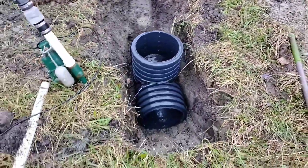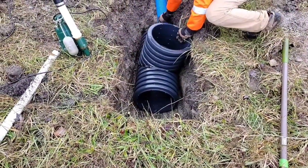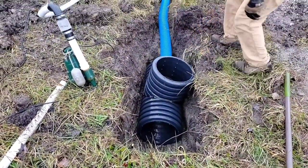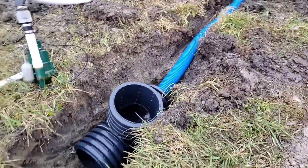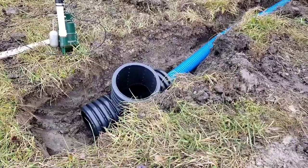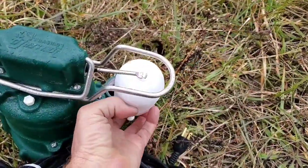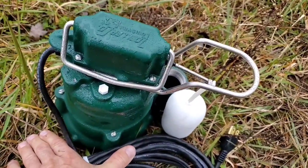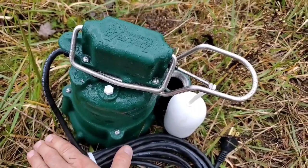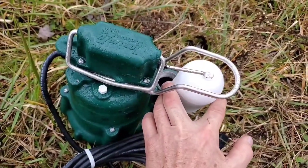Enjoy, everybody. So we're going to show you why it's important to always buy your sump pump system depending on how deep your trench is. That's how you dictate how tall your outdoor sump pump system needs to be. So we have our mock French drain come up inside the sump pit 10.5 inches, plus you got whatever you have for a housing that this is sitting on. So let's just say 12 inches. We need 12 inches of water to turn this on.